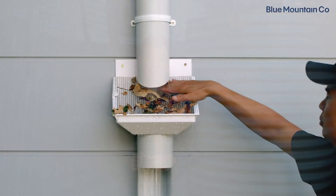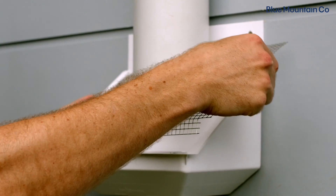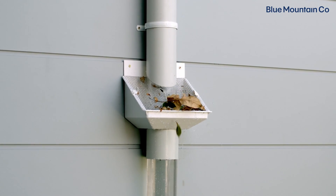Because of this, filtering leaves and debris out of your rainwater harvesting system is vital. Filtering should be used to prevent any leaf and debris from entering any pipes. The easiest solution is to install a rain head with a mosquito-proof screen on each downpipe. This is going to prevent leaves from entering the system as well as provide the benefit of preventing mosquito ingress.